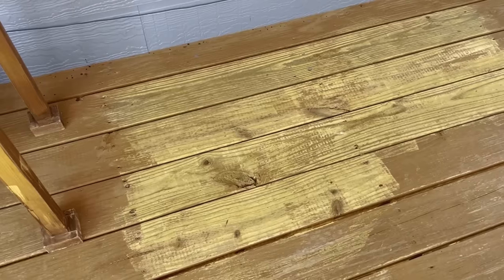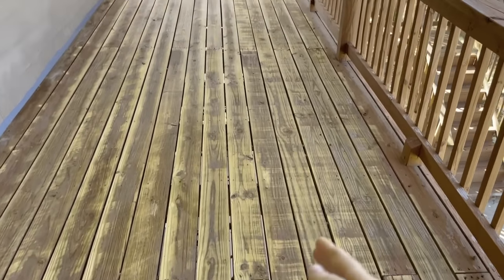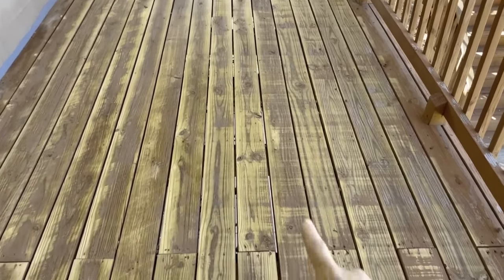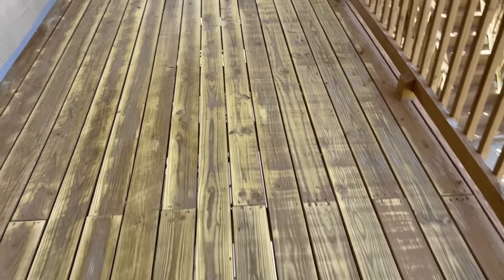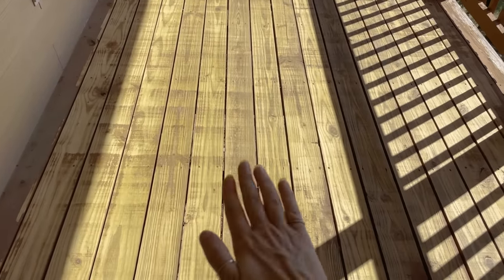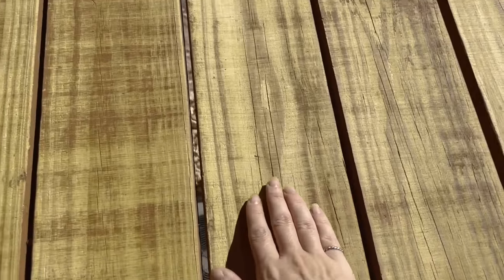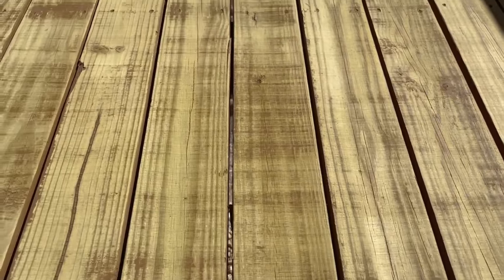On the sanding I'm going with an unorthodox method, so hear me out. Let me take you to my top porch where I did a few tests first. It's typical to use these sanders going with the grain direction of the board — pulling along the deck. However, after two passes doing just that, it removed some of the old finish but a massive amount of chemicals would still be needed to remove the rest. Over here I turned the machine 90 degrees to go perpendicular to the grain, and in one pass it removed almost 95% of the finish. Looking closer at the grain you can see some chatter, but in my opinion it looks fine and isn't nearly as bad as the pressure washer does with the chemical route.